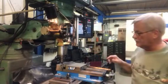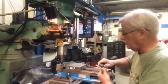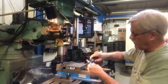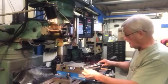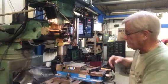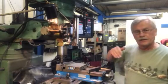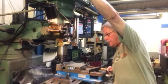Forgive me if you can't see all this stuff up close, but in subsequent videos you'll be able to see a little bit better. I saw cut these blocks and they finish at six inches, so I've got a caliper here — zeroed out at zero when closed. I'm going to measure the overall length of this block as it's cut right now. I left an eighth of an inch of extra material on there because I'm going to square it up and bring it to size. We'll take a reference cut, then flip it around the other way and finish it to length.